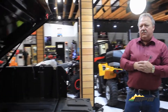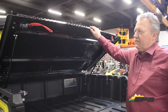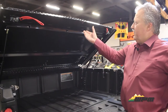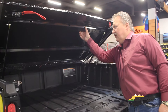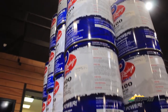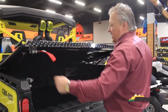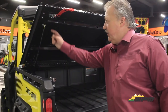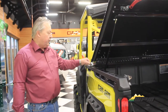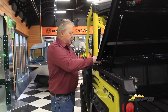Now we're basically complete. The cover is mounted to the front. This is made out of 10 gauge, or 1/8 inch, checker plate. We have it reinforced here, here, and here. This will take up to a thousand pounds of weight on the top. It's easy to take off — all you do is take your gas shocks off and remove your links, and the unit will come off. It's quite easy to put on. Thank you.